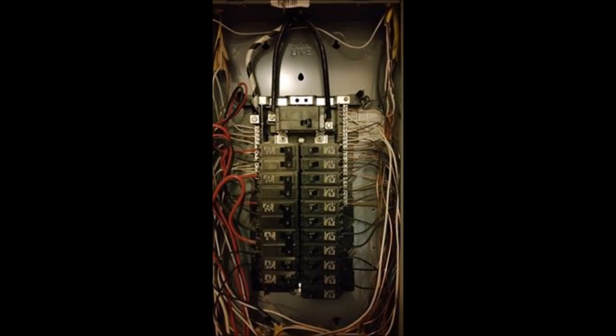In real life the panel looks insane but it's not that complicated. The left side with the white wires is your neutral bar. The right side is your ground wires, which go to a grounding rod. The neutral and ground are connected. The big wire with white wrapped around it is your neutral from the street. The two black wires coming in are your hot wires, each delivering 100 amps to each side — that's 200 amps total. Those run to your breakers, and your breakers carry the hot wire to all your outlets. It's very simple.